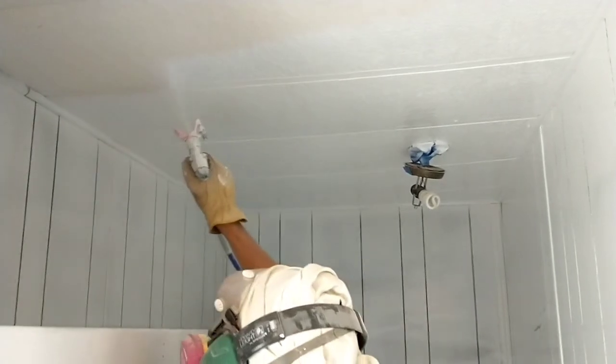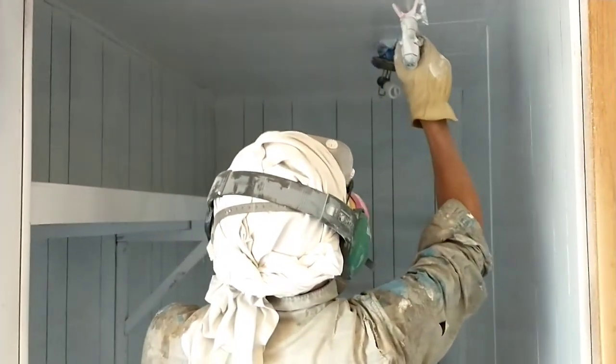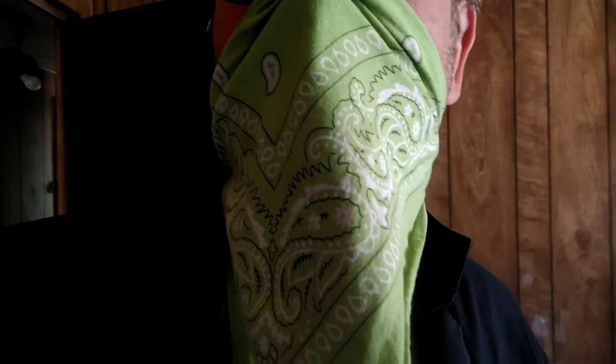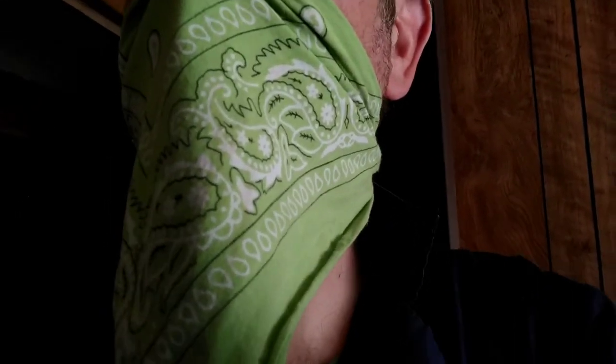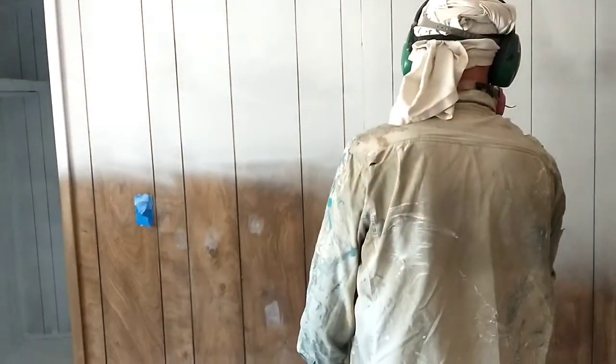Can I come in there, Brooke? Yeah. You're too close, too. 12 inches. Move along at this slow pace. I think this way you wind up with drips and stuff. Okay. And I think you need a little bit more pressure, too. And long strokes. Long strokes. I just turned up your pressure a little bit. Hopefully you won't get that trace line down at the bottom.